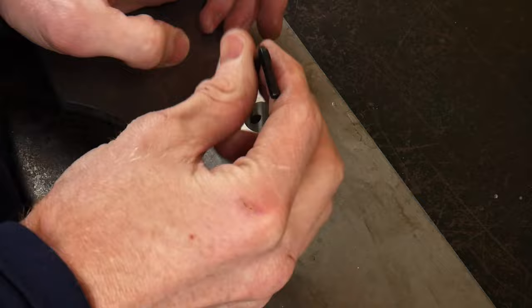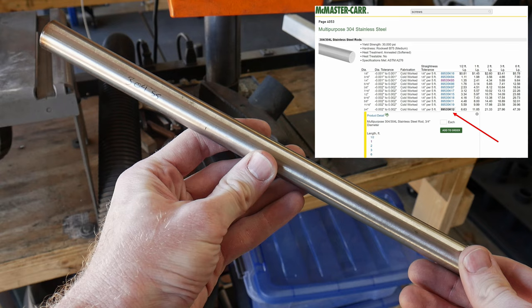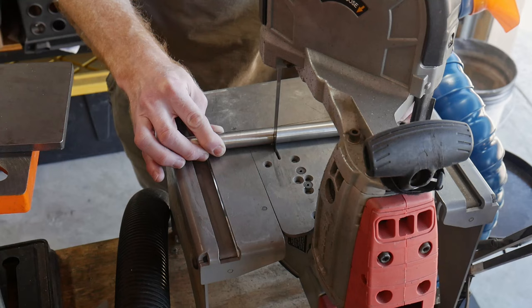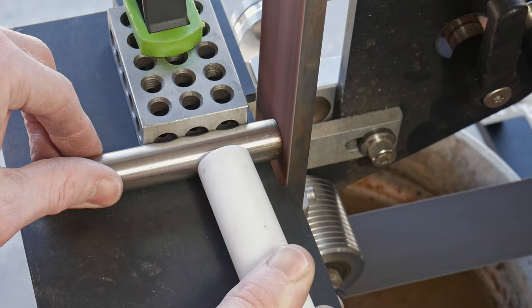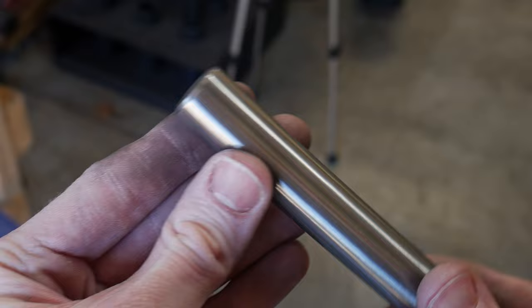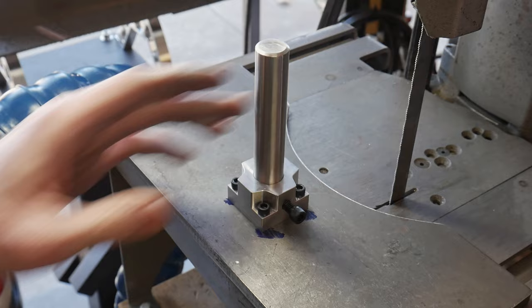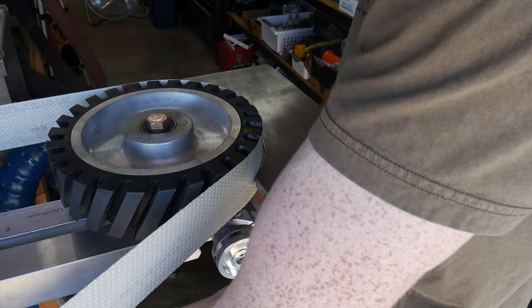Once you have these holes drilled and tapped and the bracket attached to your work rest, the only thing left to do is to cut a section of three quarters of an inch stainless so that you can attach the work rest and bracket to the RAT arm. I cut off a piece of stainless and then used a grinder with some fences set up on the work rest to get nice finishes on the ends of my three quarters of an inch stainless bar. I took down a little bit of the OD of this bar on the top of the grinder so that it could fit into the mounting bracket and also into the RAT arm. I had a pretty tight fit on the mounting bracket and took down the OD a little bit more after that. But yeah, this is how it turned out and I think I'll be using this thing a bunch.